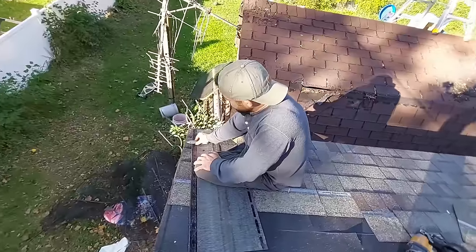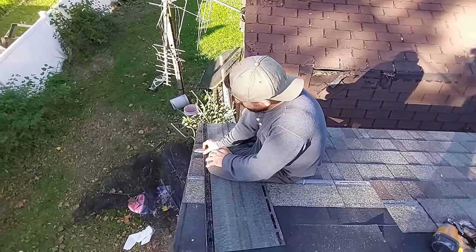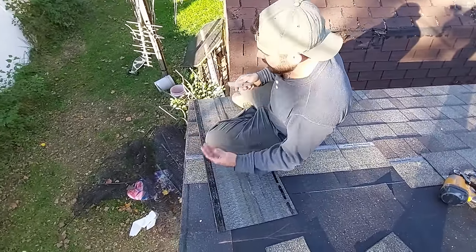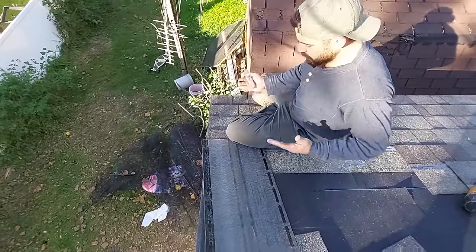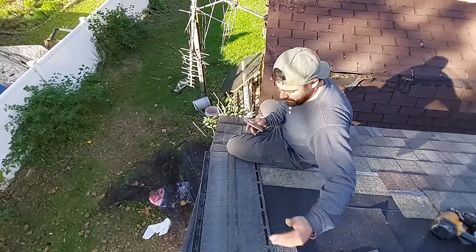So if you wanted, rather than putting that second shingle overhanging, you could have cut that second or third or even the fourth shingle all to fit, and then that way you didn't have to do this close to the bottom. Then you could have just started that on your next row when you're back into the comfort zone. Right, that comfort zone's about four shingles and up.